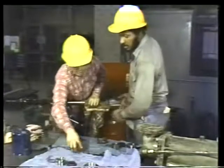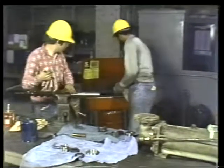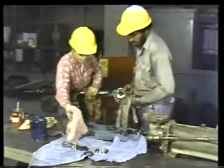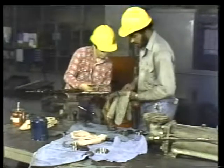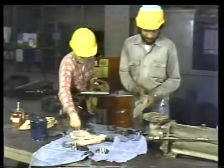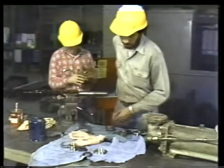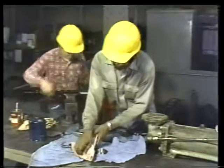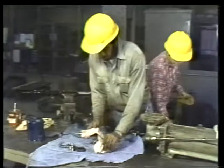By this time, the other parts have been cleaned and are ready for reassembly. Set the parts of the worn seal aside, except for the end plate and bearing spacer. Then you can begin reassembling the rotor by installing the new seal. Remember that the new seal parts might not be exactly the same shape as the worn ones.